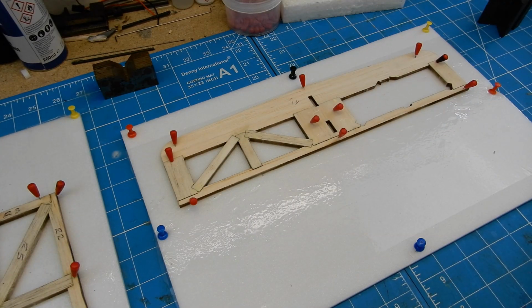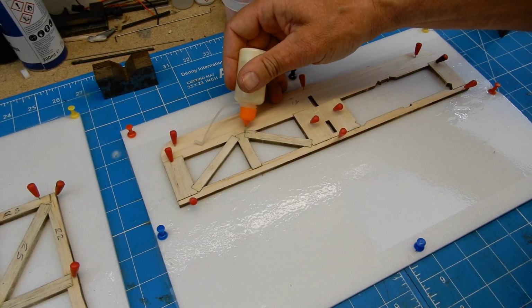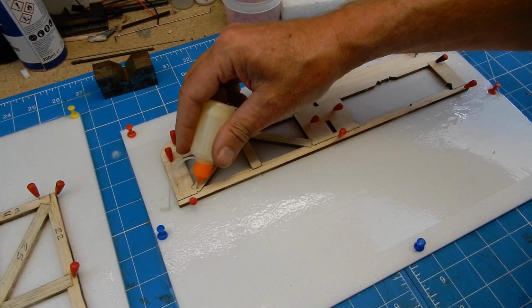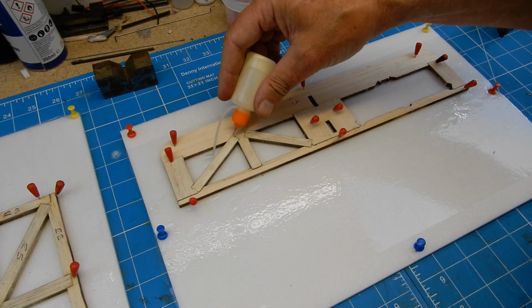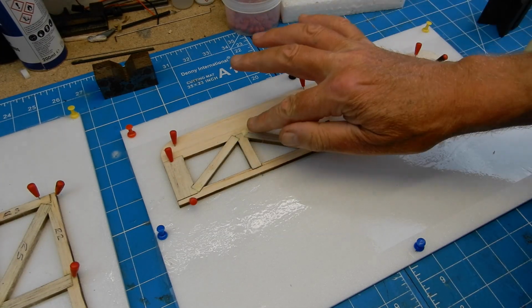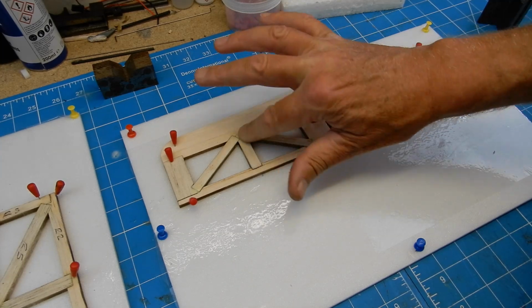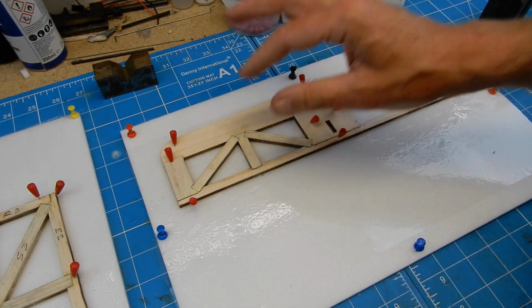So a little top tip I do occasionally do, so you've got a joint area like that. Look, there's obviously a little gap there, and a little gap there from the laser cutting. What I'll sometimes do is put a little bit of wood glue on there like that, and then I just massage it in all the holes. It means when you come to sanding it, you get a really nice finish.